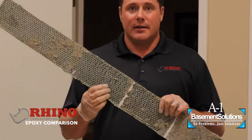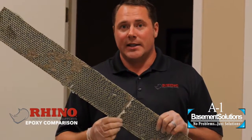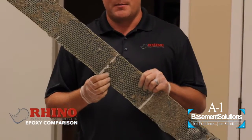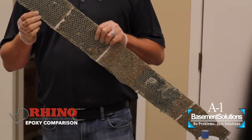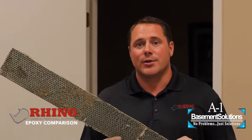That's why you scarify the wall — to make sure that you have all the surface sealants off of it so the epoxy can penetrate back in. This particular epoxy doesn't do that. With the Rhino carbon fiber epoxy, if we did the same thing and took a strap off the wall, you'd have literally a quarter to three-quarters of an inch of concrete on the back of the strap. It rips the block in half, which makes it the strongest system today.